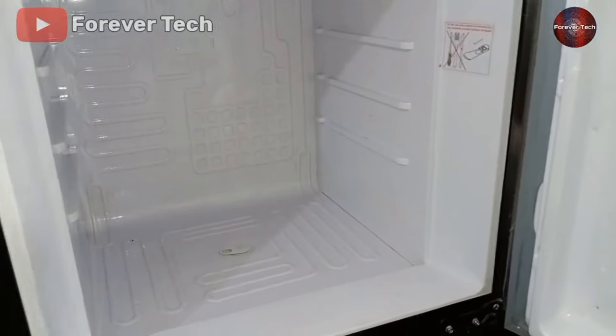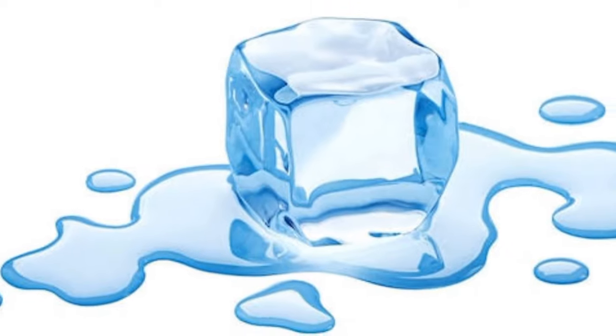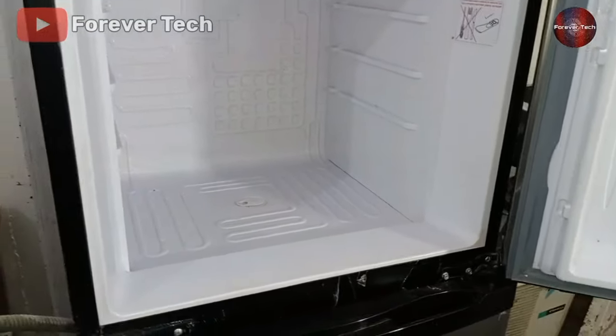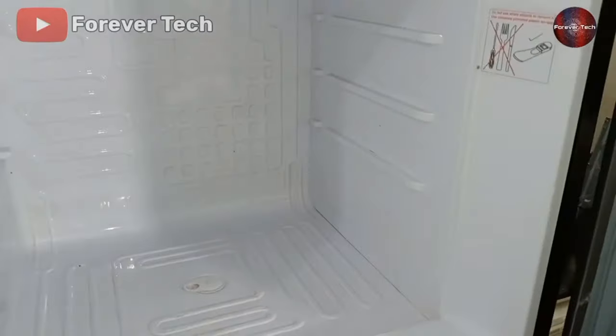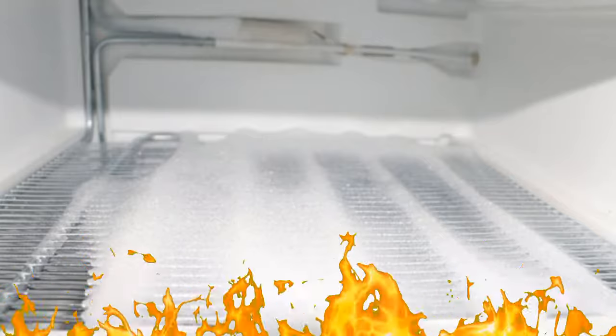You should open the door when the fridge is powered off — air will circulate and the ice will melt quicker. If a thick layer of ice is built up, warm some water in a steel or aluminum bowl, place it inside the refrigerator, and close the door. Due to the heat, the ice will start melting quicker.